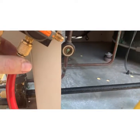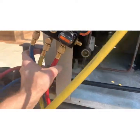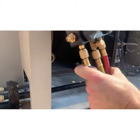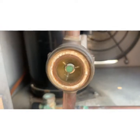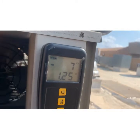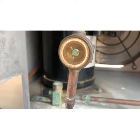It's going to start bubbling again though, I'm pretty sure. And right now, you've got all the refrigerant locked up on this side of the expansion valve downstairs. Once the valve starts sucking it out of here, there it goes, see? I'm trying to stay out of the wind. Alright, so I put in 7 pounds. That's for the unit pre-charge, not the line set. So I'm now going to use the sight glass as she runs, and look where it is. I'm filling it in.